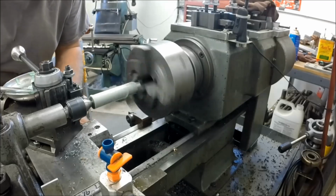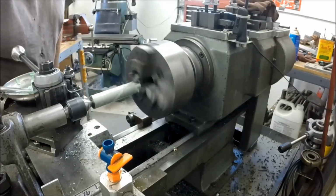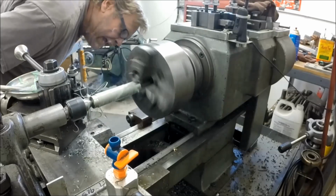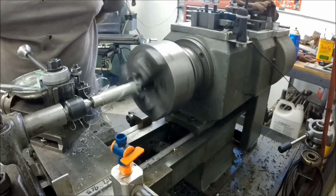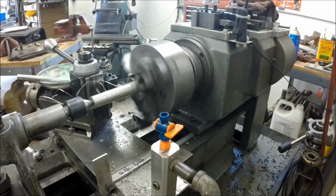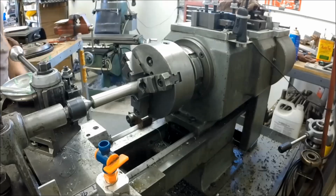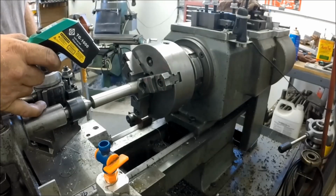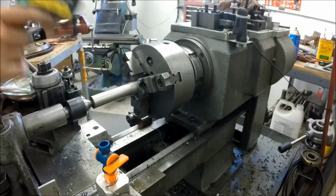And no signs of work hardening. Just touching there, I'm going to go 10, 20, all over. We'll do 30 thousandths depth of cut at this RPM. I'm running at 250 right now. 30 thousandths depth of cut, and eight thousandths per rev. And what a bird's nest we got going here. Okay, 8 thousandths per rev, 30 thousandths depth of cut, 250 RPM. Still 104 Fahrenheit, 39.9 Celsius.